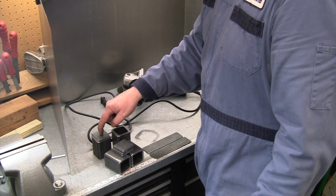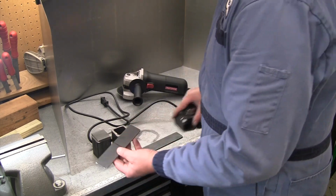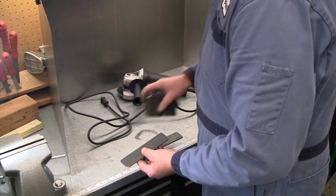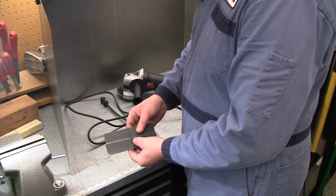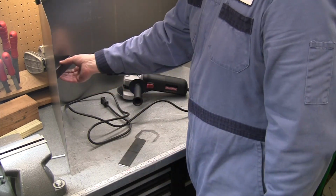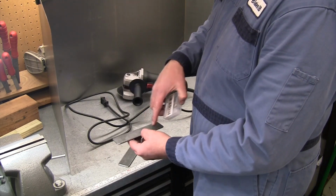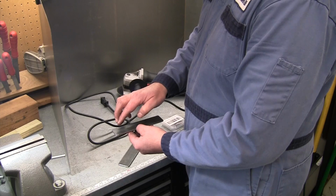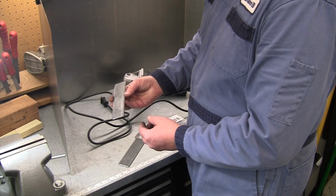Drill and tap the center of that, just gonna do that in the lathe on the four jaw chuck. And before we get to that piece though, we're just gonna finish making our spark shield. So I'm gonna take these two pieces, just gonna bend them in the center and get them to where they have that nice angle, they fit in there, and then we'll contact cement a couple magnets, probably put two and two, so have definitely lots of magnet power holding those things on.